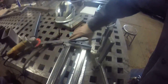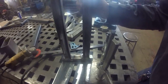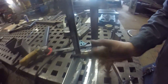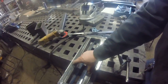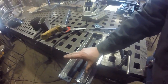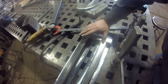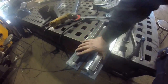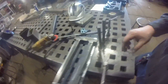I got my frame all welded up. I welded it solid all the way around. What most guys aren't doing is they're not welding these things around - they just slap it on and stitch it up, thinking that's good enough. But this reinforcing frame is all the strength. What we're trying to prevent is a torsional twist. This guy actually pulled slightly out of whack as I welded it, so I had to straighten it back down again to get it level. Now that it's level, we're going to get it welded onto the actual frame itself.